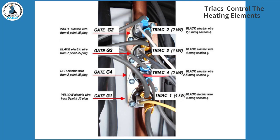You can see the illustration of the four triacs on this particular model. On the other model that has an unvented cylinder inside it, there's a fifth triac. The four triacs handle the 12 kilowatt output on the main heat exchanger, and the fifth one controls a second element for the unvented hot water tank, which is heated and controlled by that separate triac.